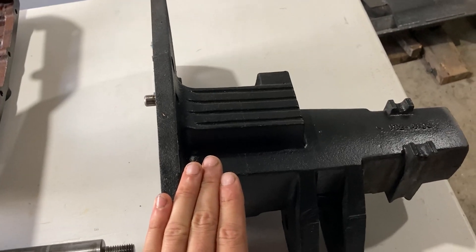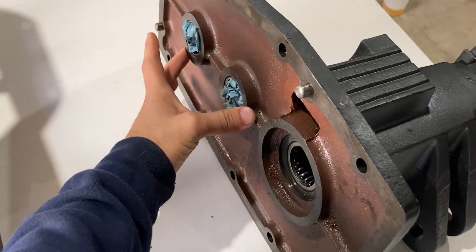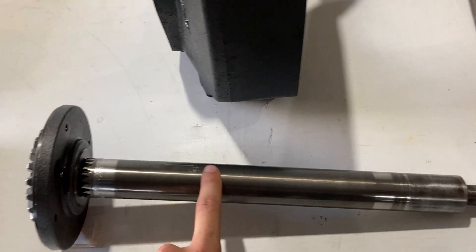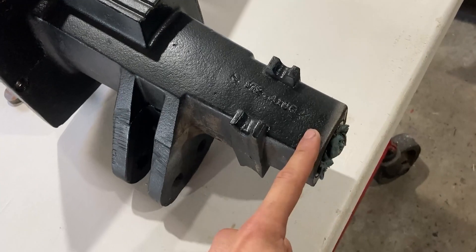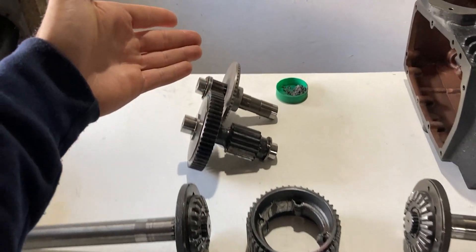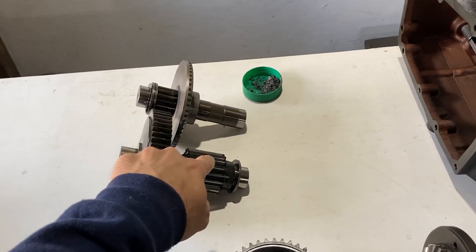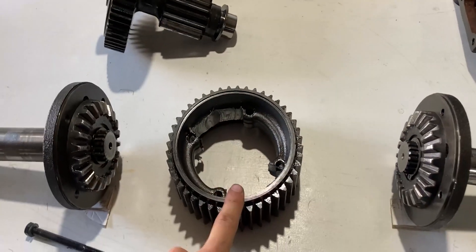Off to the right we have another side of the axle housing — three bearings in line once again, which hold the two top shafts, and this bottom bearing holds the right axle. Same setup: we have a bearing on the outside and then one more seal which I will be replacing. When I come to the middle, we have our two top shafts which create the transmission. This bigger gear transmits power to the smaller gear which is on the same shaft, and this gear transmits power to the bull gear.